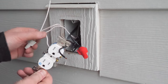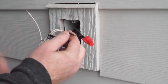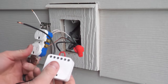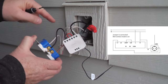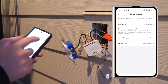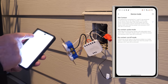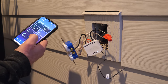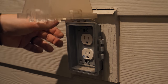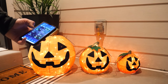Now let's connect the T2 to an outlet to make it smart. Here I have a neutral bundle — one wire connected to the switch goes into the T2, then the line also goes into the T2 with one connecting to the switch. Neutral connected to neutral, line to line, jumper cable in place, and L1 connected to the outlet. In device settings, switch type is set to disabled since there's no switch for this, and device mode is set to wet contact. Now we can turn the outlet on and off from the app.